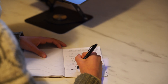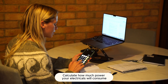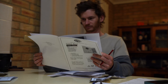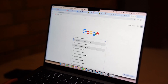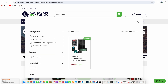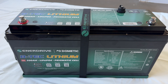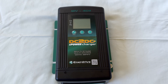Your first step is to list every single electrical that's going to be in the van, then figure out how much power all of those appliances will consume. You can do this by downloading user manuals online — you're basically looking for how many amps each appliance draws. You can also find online formulas to calculate how much power you'll need. Now you're ready to purchase your power system. Going off your requirements you can find batteries, chargers and solar panels to fit your needs — for example we chose a 200 amp hour lithium battery charged by 380 watts of solar and a 40 amp DC to DC.